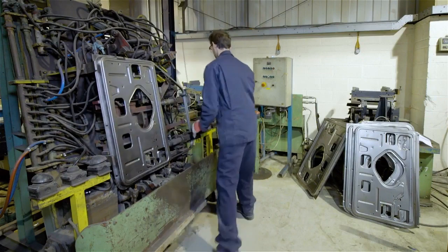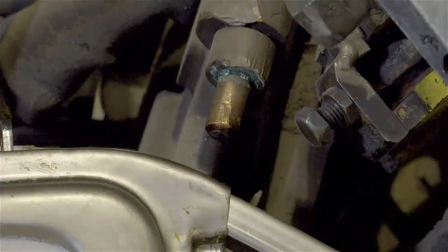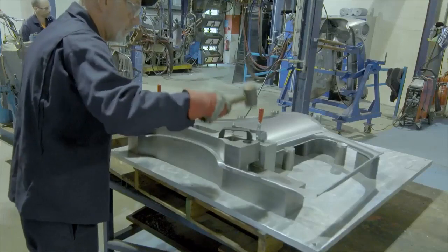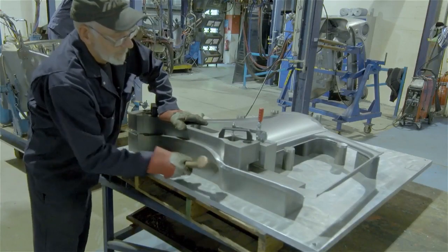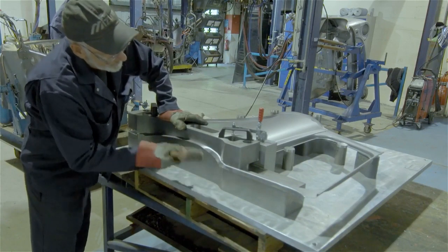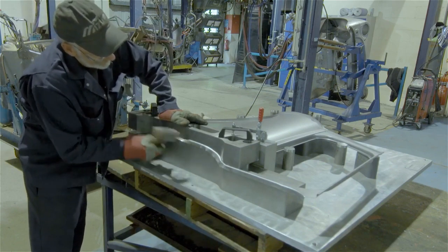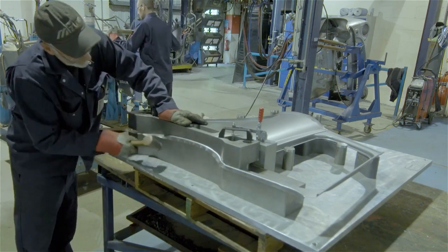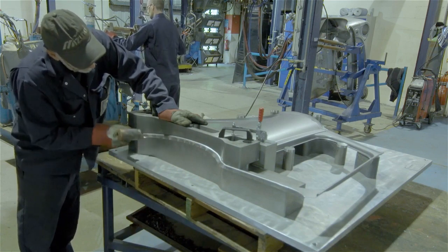When we embarked upon the Mark 1 body shell, we knew that very little tooling still existed that was specific to the earlier models from before 1969. To have invested in complete new tooling for these pressings would only have made sense if production were to be in the tens of thousands, not the planned hundreds or so body shells a year. So, some workarounds had to be found, good enough to please most enthusiasts, like this reforming of the rear of the door opening in the later side panel.